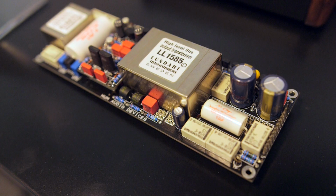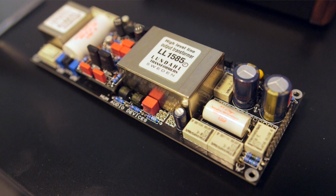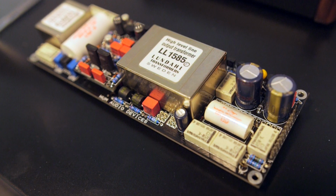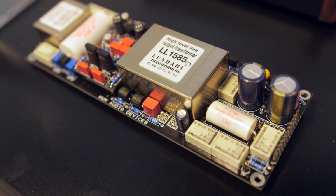Can you tell us about the circuitry within the microphone? What's going on with the preamps, transformers, op amps, all these sorts of things? What are you using inside? Yes, I use Lundahl transformers, input and output transformers. All discrete electronics inside. The op amp is all discrete, based on a Jensen design. Generally, everything is THT, no SMD inside. So it's of course handmade, hand soldered.